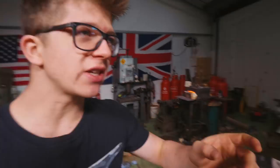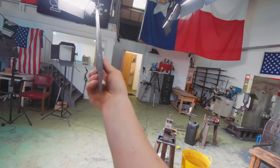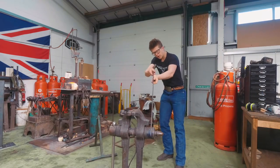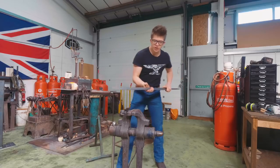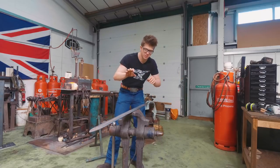We've straightened it and done one normalizing cycle. It's now the next day and looking at this, it still didn't straighten — it still looks very much like a banana. That's not good. The issue is that normalizing is the process of removing stresses from the piece of steel.